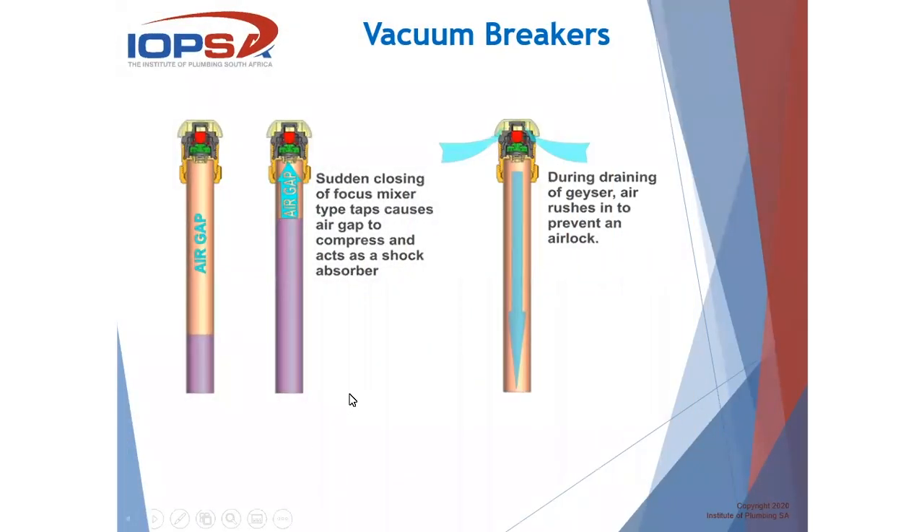This is an explanation of how it works. Our vacuum breaker is a one-way valve — it will not allow water to discharge, but it will allow air to go into the system if and when needed. When we fill up our geyser, this standpipe will not fill to the top with water — there will be air there. That air gap acts as a buffer or absorber: if a tap is opened and suddenly closed, the air gap — due to the fact that air can be compressed — will absorb the shock of that sudden stop of water flow. The main function is to allow air into the system when we need to drain the system.